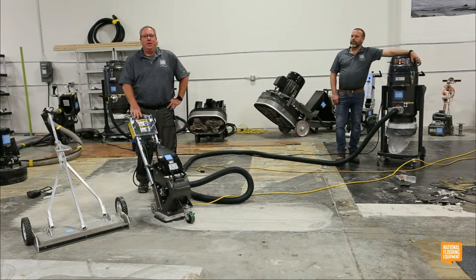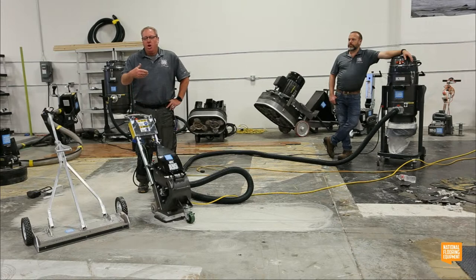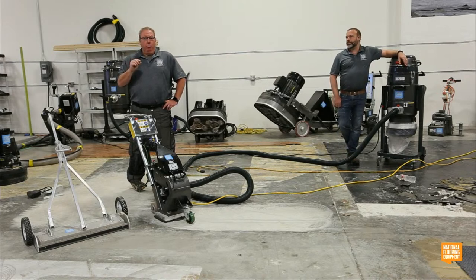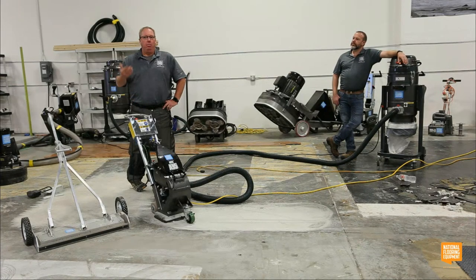Yes, typically, because that's really the question: will the A95 blast a Home Depot or Lowe's really high quality epoxy with flakes in it? I'm being kind. I don't know who's watching this ever. I don't want to make any enemies. Yes, it'll take it up. If it's 50 mils of really hard epoxy in a Dana Corporation plant, it's not getting it. It doesn't hit that hard. You have to get a bigger blaster with bigger motors that hit harder to remove really thick coatings, and in some cases, a scraper.